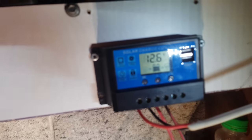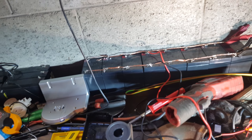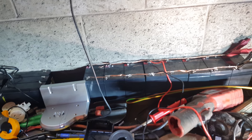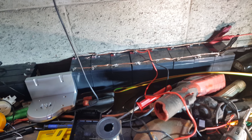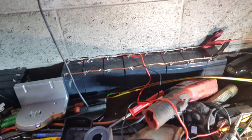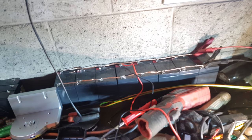I'm pretty impressed with my little battery pack - still at 12.6 volts. They're just out of a 48 volt UPS. There's eight 5 amp hour cells in there, so 40 amp hours total, which we'll actually test with the big discharge/charge unit - the lipo charger that Banggood sent me. We'll see how close to 40 amp hours it actually is.